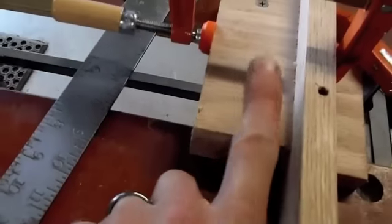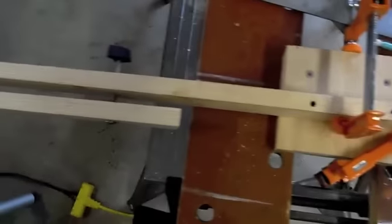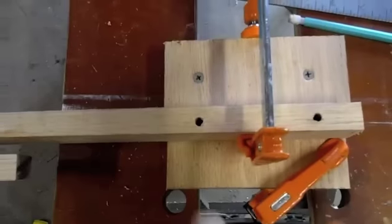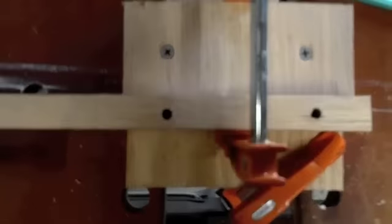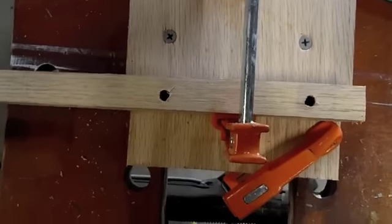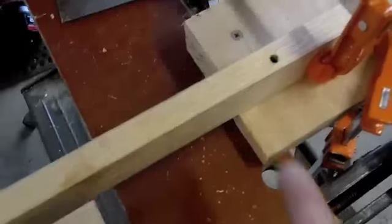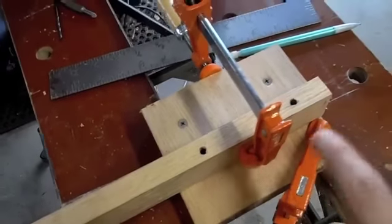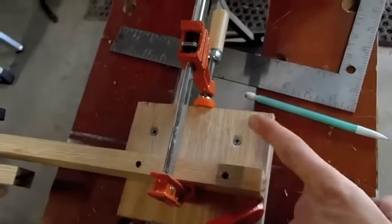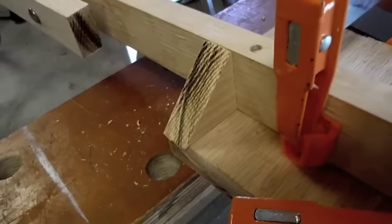I've made a little progress now. I've taken the larger backboard and put the smaller two and a quarter inch one on top, glued it, and put two screws through it. I've taken my mount and laid it over — I already pre-drilled two of the holes, but if you have a drill press that would be nice to get exactly vertical. I'm using the top as a template for the bottom and going through both at the same time, putting carriage bolts through to attach the cross beam to the back mounting plate. Then we're going to cap it all off by putting on these little 45-degree elbows for some extra strength at the end.